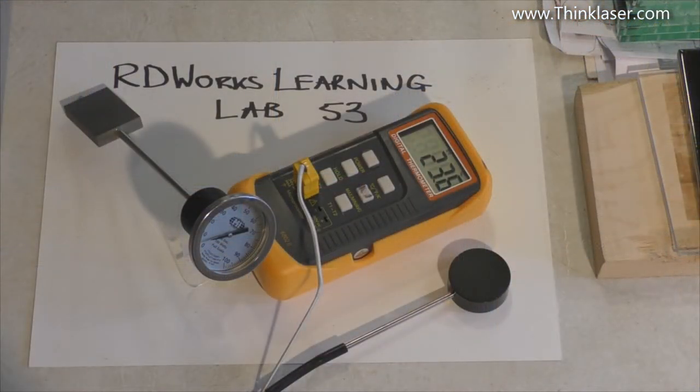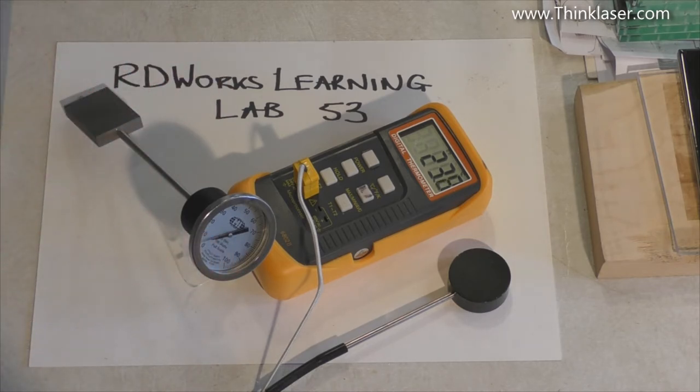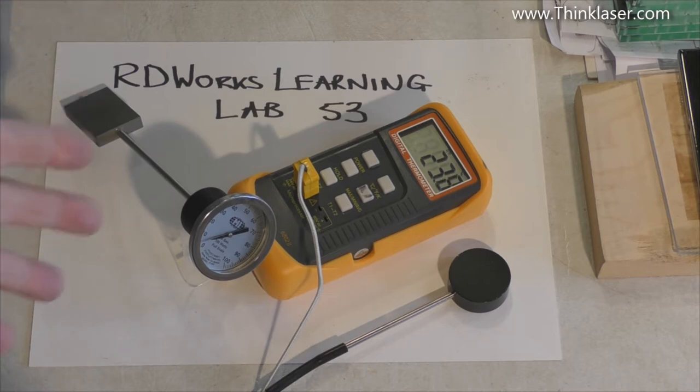When I first got my original China Blue laser machine it had a very poor quality tube in it, and I struggled for a long time to prove that the power in that tube was not as claimed. I spent a long time trying to devise ways of measuring power through calorimetry techniques, and in the end I had to give up and search the internet for a reasonably priced power meter. On the surface of it, it looks like a meat thermometer with a blob of anodized aluminium attached to the stem, and in essence that's what it is — but it's a very expensive piece of equipment for hobby use.